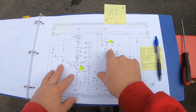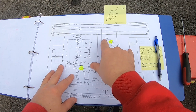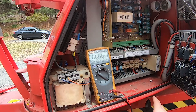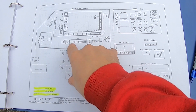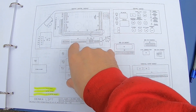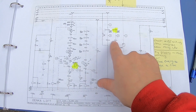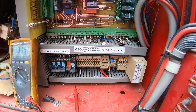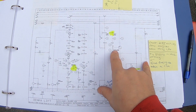So I suspect we have to work our way back. Let's check X249. If we don't have voltage there but we have voltage on U13, then we prove that moment limit switch one is the culprit. Looking in the control cabinet, this bus down here is X2. Directly next to the K25 relay we've got X249. We do have voltage there, which indicates to me that the motion range limit switch — E9 — is bad.